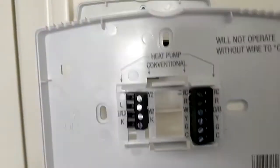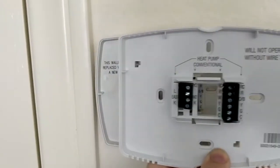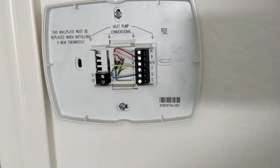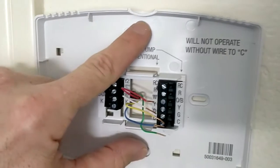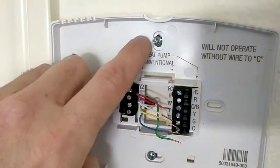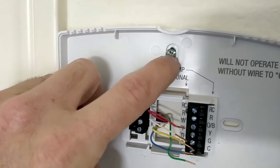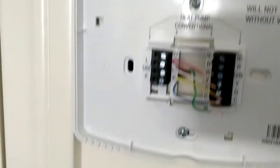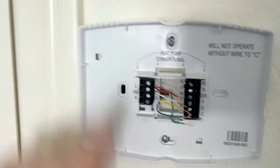I'm going to add that green, as-yet-unconnected wire down to the C terminal. I'll pull the wires off with a flat blade, pull out the base plate, and put this new one on — it's slightly larger so I thought I'd have to move the mounting holes, but wonder of wonders I was able to use the old holes. I just modified the plastic slot slightly with a drill bit so the screw would move over to the left.